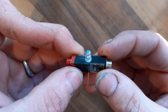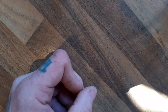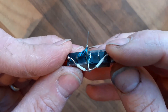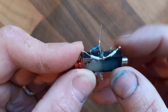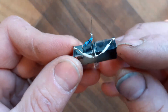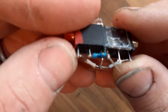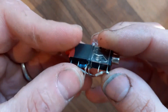The next stage is to connect the earth wires — the grounds — which are here and here, to the ground on the LED, which is the short terminal. For those of you that are new to this, nothing too fancy — just a wire slung between the ground points, and then a 1k resistor added to the signal path and to the long leg of the LED.